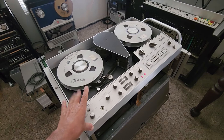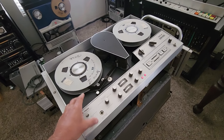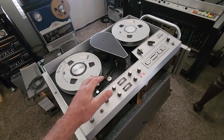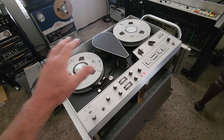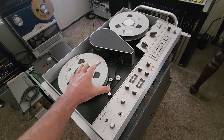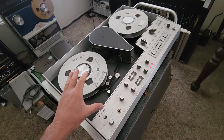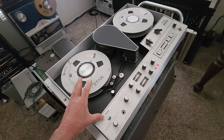When you're repairing these machines — these VR 7500s and especially these Type A machines — it takes a lot of parts and a lot of configuration. You have to have the tools to set up the tensions, because there's a lot of tension from the take-up reel to your playback reel. You want to make sure you get the right tension around the drum so that if you do have sticky tape, the tape won't stick in the machine.